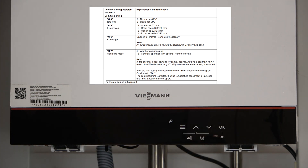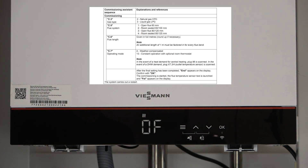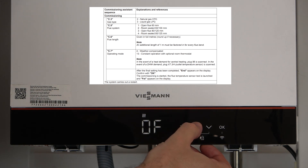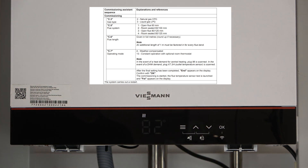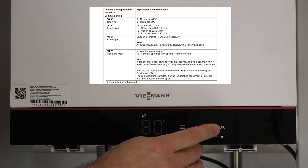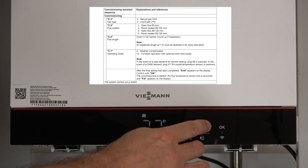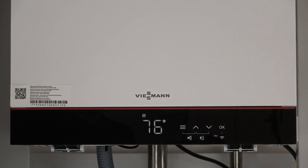As you can see, it does go to end, so press OK and that's our boiler now commissioned from the front panel. You can see it's gone to standby mode — to wake it back up, press the menu button and it goes to the main screen. I've set this boiler so the flow temperature is to off. If you wish to put it back to on, press the menu button up and hold it in for at least four seconds and it turns the boiler back onto the flow temperature. The flow temperature on this one is set to 82. If you wish to adjust the flow temperature, use the up or down arrows, not forgetting to press OK to confirm. That's our flow temperature set.